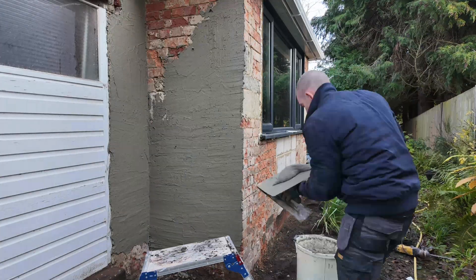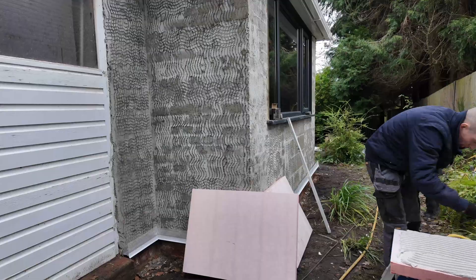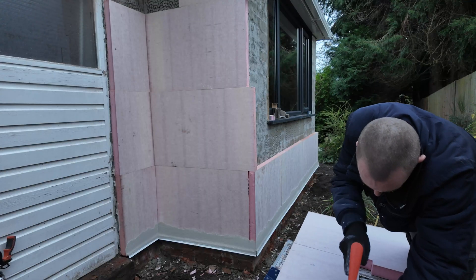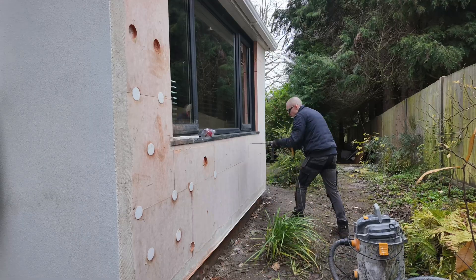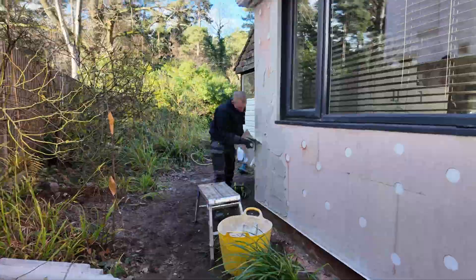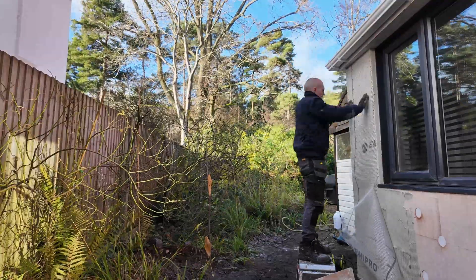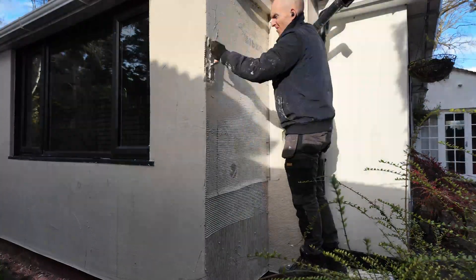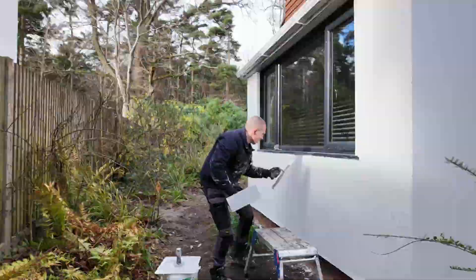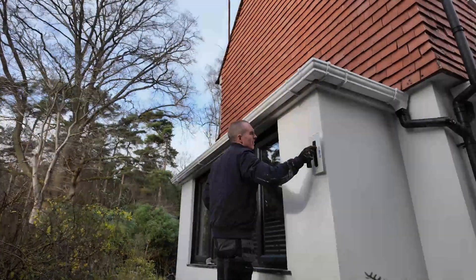Now all I have to do is dig a massive hole in the ground without putting a spade through the electricity cable, because that would be shockingly bad. And I have to buy and fit an electricity cabinet. I did end up taking a bit of a diversion to install external wall insulation where the cabinet is going to be — I didn't want to put the cabinet onto the wall where I knew I wanted external wall insulation, as there would forever be a penetration in the insulation, a cold spot in the wall. So it made sense to bite the bullet and get insulation up on this bit of wall before the cabinet went up. I managed to get everything done just in time for alteration day. The DNO were due to turn up in the morning and, just to make me nervous, they didn't show up until 11:30. So this was it — the point of no return.